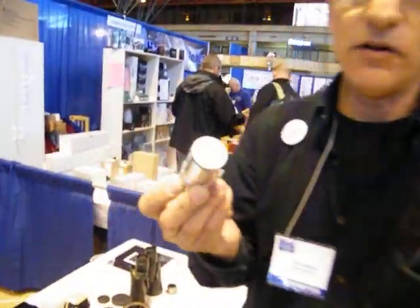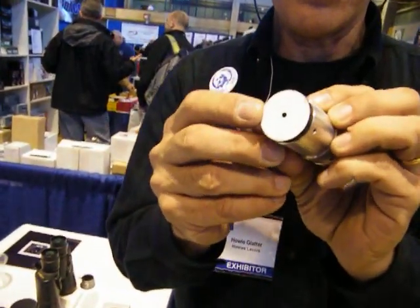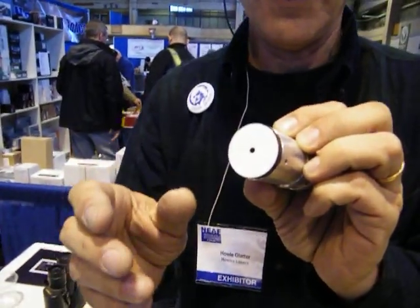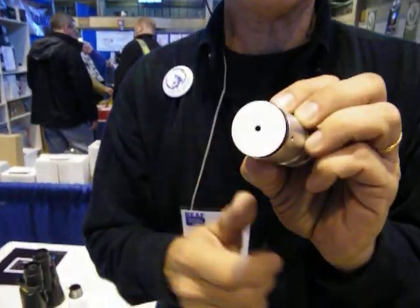That's our latest product, available at Camera Concepts or at collimator.com. This collimator is typical of all my collimators. It has an accessory aperture stop — a one millimeter pinhole — which reduces the beam down from its native laser diode elongated fuzzy-edge beam to a tiny circular point.